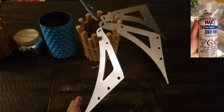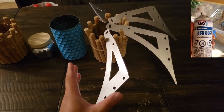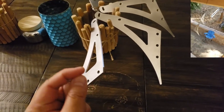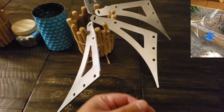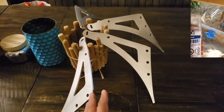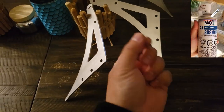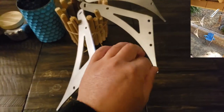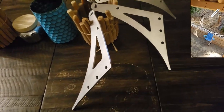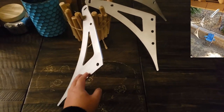So as for the dry time, I tested it out a few times, that's why I got a fingernail in it. It's semi-dry within 15 minutes, okay? It's a lot like automotive paint, which it is. But you don't want to touch it, because you can still apply the second coat after 10 or 15 minutes, but it's still kind of wet a little bit, so it's semi-dry. So it's about 5 to 6 layers of the clear coat I put on this. After 3 hours, I got my little fingernail here. I put it pretty deep, so I touched it up a little bit. When it creates a dip, it fills in. The liquid still fills in when you spray over it.